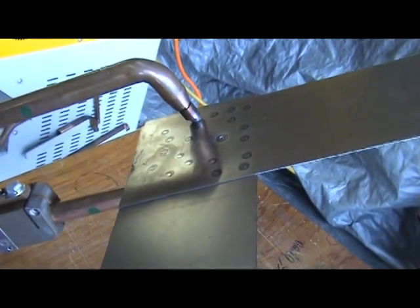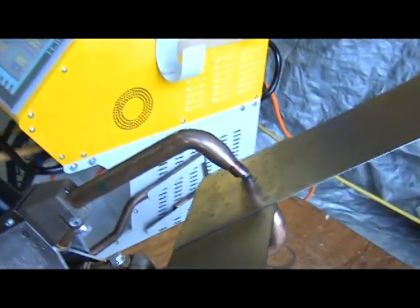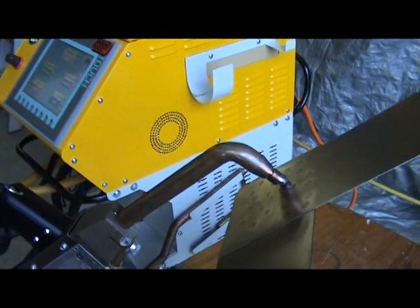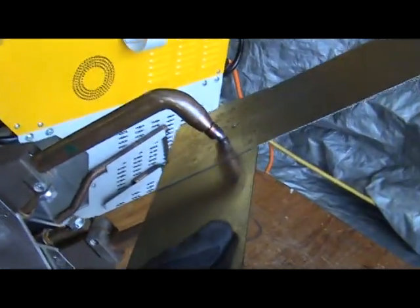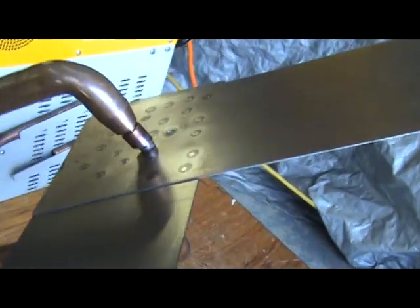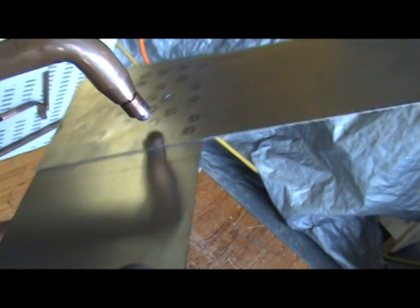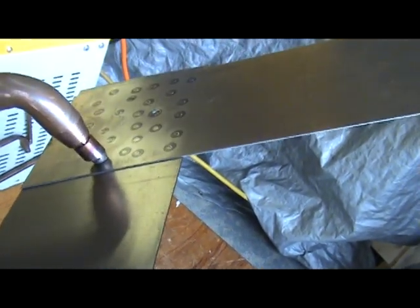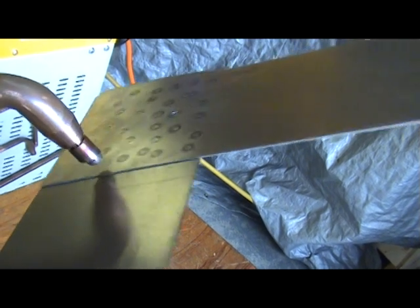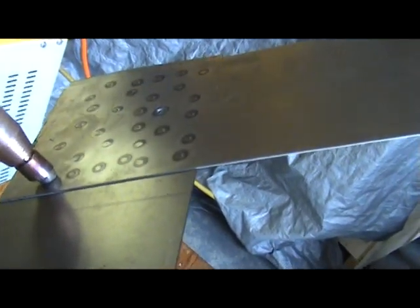This time the spot welding will be conducted continuously. Hundreds of welds can be done without any problem. The transformer will perform very smoothly and consistently. Cooling water travels all the way up to the tip, which allows for better cooling and higher performance.